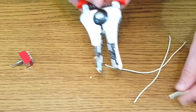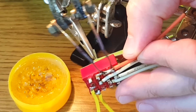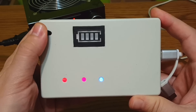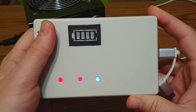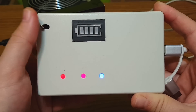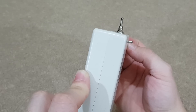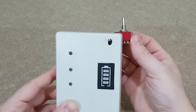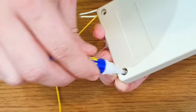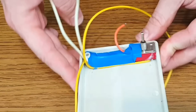For turning on the power bank, I will use a toggle switch with 4 poles and 2 positions. All these wires are necessary because in one position the power bank is turned on so all the cells are connected in parallel; in the other position the supply current will reach the charging modules and the pairs of cells can be charged individually. It's a bit difficult to place the switch in this position, but if I attach it in the regular way on the side of the case with a nut, it will stick out too much. There is very little space available, so I will glue the wires to the plastic case and insulate them with electrical tape.